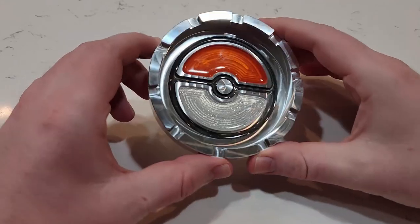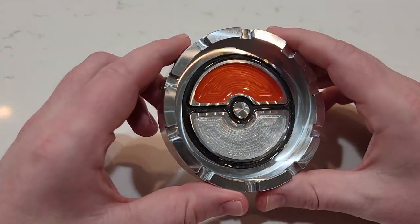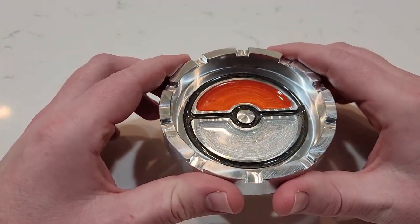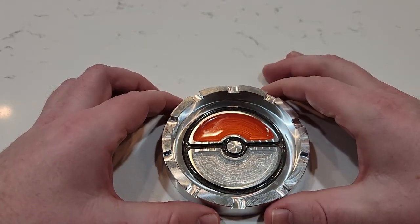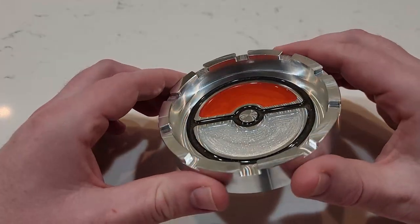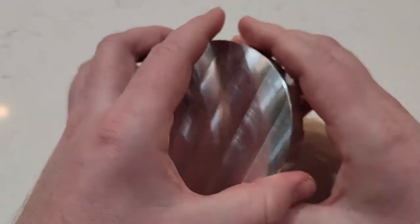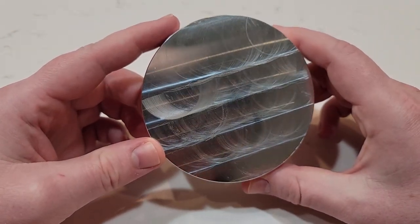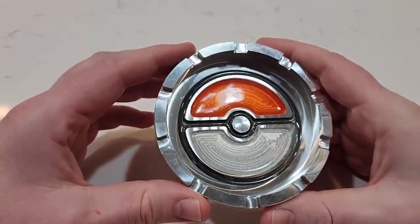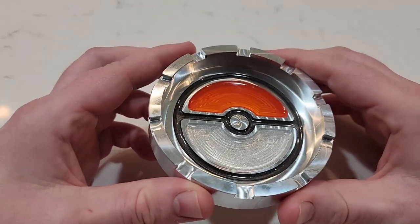Welcome to Smith Coating and Design. This week we decided to experiment with epoxy resin. I made this Pokeball ashtray for my brother. For the most part it came out all right. You'll notice when we get into the Tormach operations that I actually decided to cut the 6061 dry, which was new. I decided to do that for filming purposes. For the most part the finishes came out okay, though I am not satisfied with the surface finish on the back. It turns out the shell mill did not like cutting dry, so in the future I will avoid that. Overall the epoxy went in smooth and it seems to be holding up fine. We'll go over that in a few minutes, so hold on tight, and now we'll get into the machining.